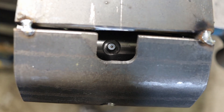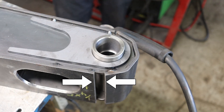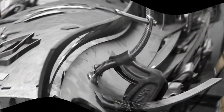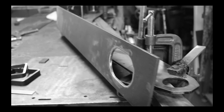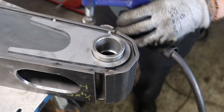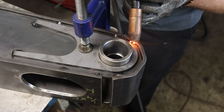Since all the skins were tacked in, it was time to put the gussets. And yes, you probably spotted it already, but there's a three-quarter-inch gap. Going back five minutes — I messed up and warped the first skin, and used what was left from the initial 20-foot flat bar for the other skins. But if you don't tell anyone, once I fix it, nobody's gonna know.